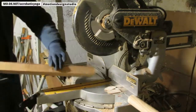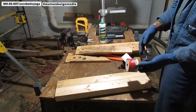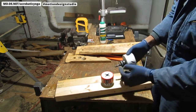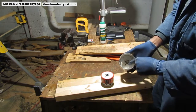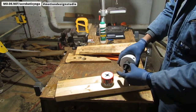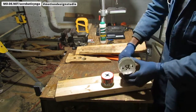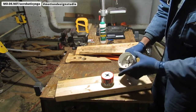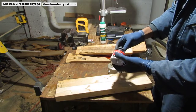And now that's flat on both sides. This diameter is 2 3/4 of an inch, which is what we want. Now, the thing about these hole saws is that you can buy these, but you need to have this also purchased. And this screws into the drill shank, and it's a 1/4 inch. But you see those little two holes there? That's what holds onto that, so that it doesn't slide. So you need to loosen this up like that to get that off. So you loosen that up, and then you turn this off. You put that in, and then this, sorry.